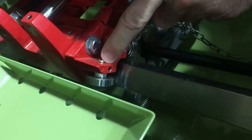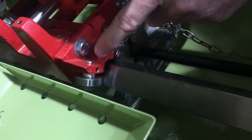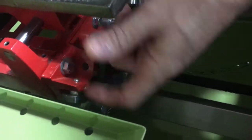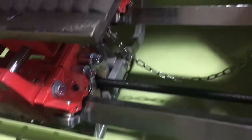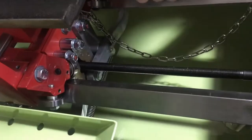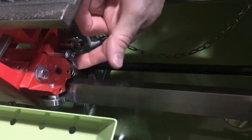The set screw prevents the bolt from ever unscrewing while the saw is being operated, because that bearing is turning. So you would remove the set screw, unscrew the bolt, and then you have the roller bearing in your hand. It's got a bushing that's pressed into it. Most of the time we just recommend pressing a new bushing into it and then reinstalling it.